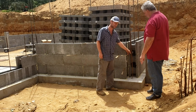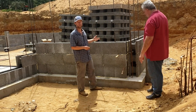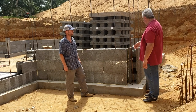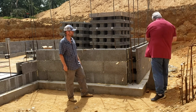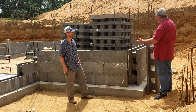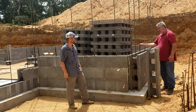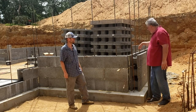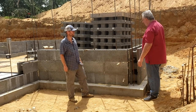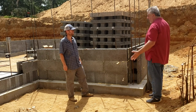The inspector can look at the horizontal bar at the base and at the bar at two feet and verify they're doing what they said. You can see the laps at the corner clearly. Each one of the cores is 12 inches on center, so rebar on 24-inch spacing falls neatly on every other core. They'll be able to lay that up, pour concrete in, and basically have a musculature — a series of concrete and steel bones — that the block wraps around.